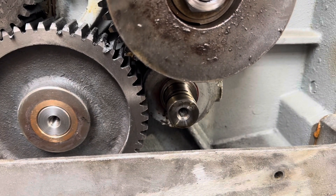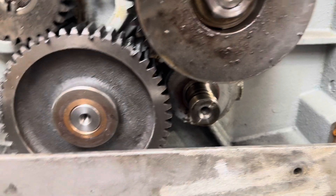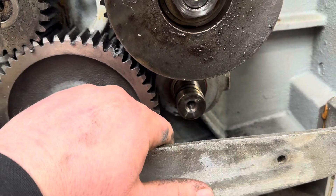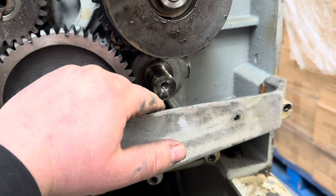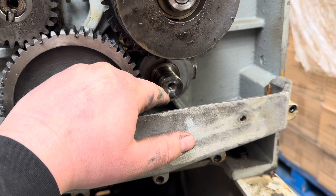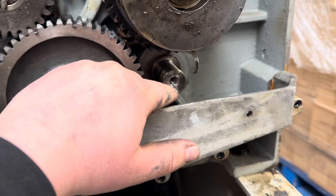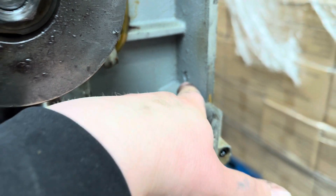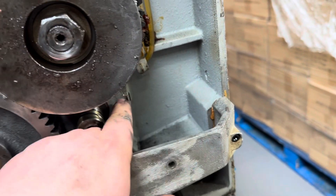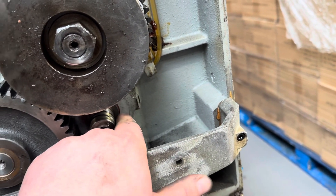I don't know whether to take this one out and copy it, because I'm pretty sure the original shaft is in the van. It's got a two stamped in the end, and that's two as well, so maybe they're the same. How can they possibly be marking out the position for the grub screw? Because it takes a dog-point grub screw. Well, look what they've done — they've drilled through the casing of the machine to use a transfer punch, I assume, to dot the point.